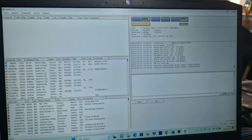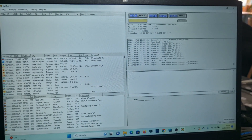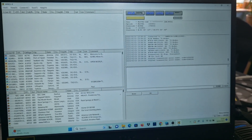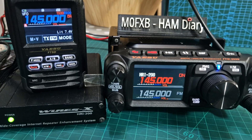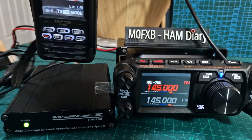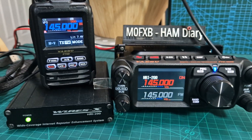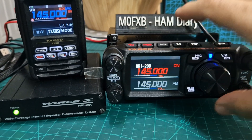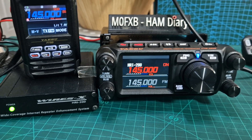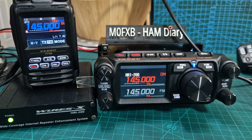Still learning on this but it's all working — I've just been testing it. It works on the WIRES-X system no problem at all and we'll do another video showing that demonstrated. With an HRI 200 box you get your own room, you can use analog no problem, and you can use any analog radio with the FTM-500, but you do lose your FTM-500 which becomes like a big hotspot — quite an expensive one. Bye for now, 73, all the best.